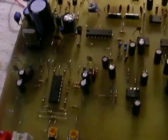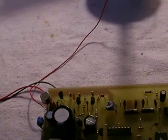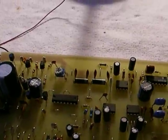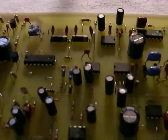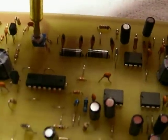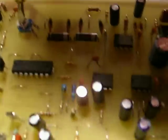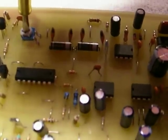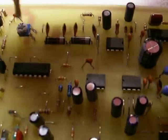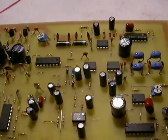The only adjustment to really worry about is this one up here. The adjustment for the RF output is very, very touchy. All the way — this one up here, the top of the board — all the way clockwise is no RF, there's no transmission. Just back it off barely until you start hearing it. Continue counterclockwise until it starts distorting. You hear it distorting right there? It's not much of a turn. That's your proper point for the antenna that you have at the given time, at this moment.